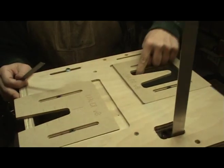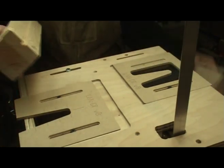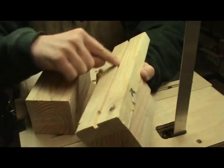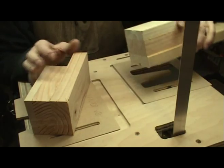And then this is the tenon side of the dovetail joint, which is going to be on the neck. I've made myself some mock neck and body here. This will be the body, this will be the neck. Notice I've cut a 1/4 inch slot for my truss rod. That way I can just put it right into the jig and clamp it in.